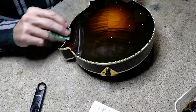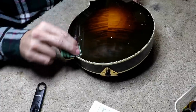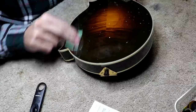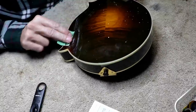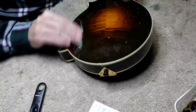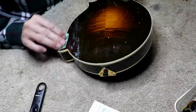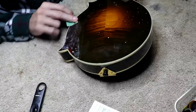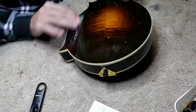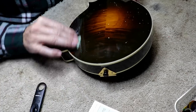Probably in the color, it almost looks like there's a dark line on the repaired side of the seam, which I didn't want to see. I don't know why there would be a dark line there. I didn't put anything dark there. It's one of those cursed things. You can't get beyond some of those things, especially with stain. If this was paint, it'd be a different story. But with these stains, it's next to impossible to make them match. Even if you do have good color vision, there's always something that makes them react opposite of what you're expecting. Unless you've done this, you wouldn't know what I'm telling you is true, but it is true. There's always something that makes them do something you're not expecting. And just like that dark line, I didn't see it until now.